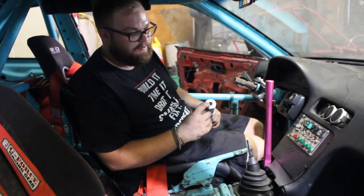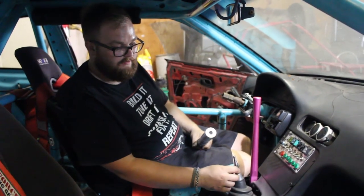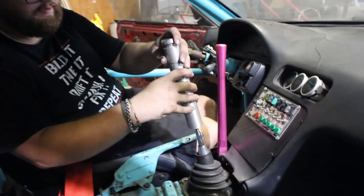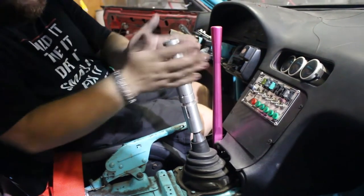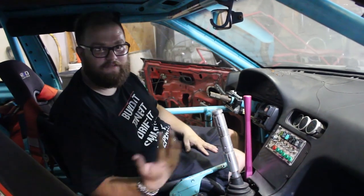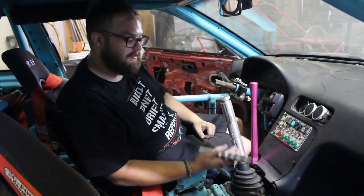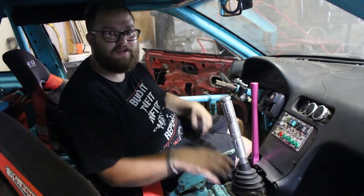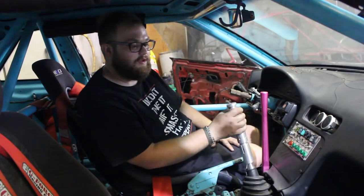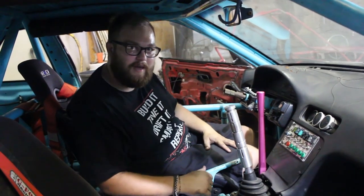Now that we have the larger hole drilled to fit over the shaft and the smaller hole drilled and tapped — if you don't have a shaft to fit over, you can just drill and tap straight to the face. Here's the finished product, let's put it on and see if it fits. It fits! So if you have any piece of material — aluminum, steel, brass, copper, whatever — this is how to drill, thread, and make it a shift knob. Give it a thumbs up if it helped, share it, subscribe, and thank you so much for watching.